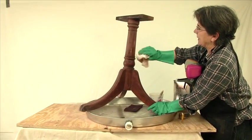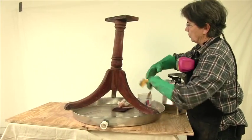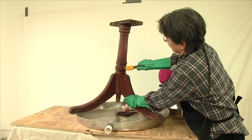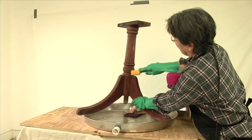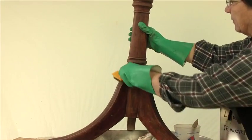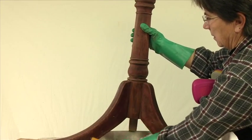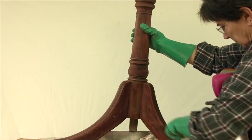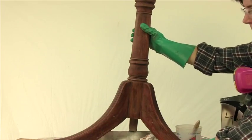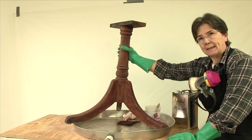If you have any paint left in the grooves, make sure you use your brass brush. That's going to take care of all that tiny little white paint that doesn't look like much now, but after you finish your table, it's going to stare at you. So let's leave this to dry, and then it will be sanded.